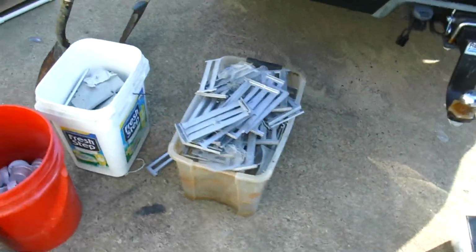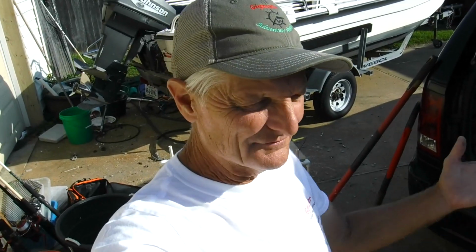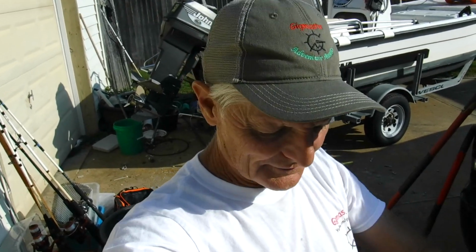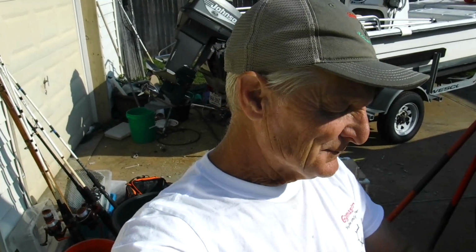Now y'all may have seen on a previous video that I had like 15 bags of cans. Aluminum cans, but cans make a mess. Cans got a lot of trash in them. They're actually coated with a plastic. They got other material in them. And when you melt cans down, you end up with a lot of debris floating in your liquid aluminum. You got to clean it out, so it takes time. So I got rid of all those before I went out on site because I don't want to spend a lot of time doing that. When I'm on site pouring liquid aluminum into the fire ant holes, I want to be real clean and fast. I don't want to have to clean and do all that stuff.